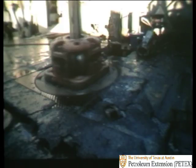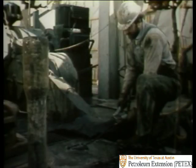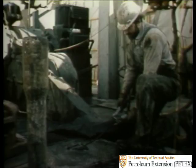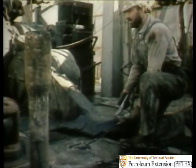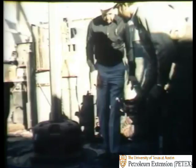There's not a whole lot you can do to ruin a rotary table. But forgetting to check the oil level daily is probably the primary one. And forgetting to grease the pinion shaft oil seals is likely to be number two. However, that's not what this man is doing. He is greasing the table lock, which is good maintenance, but not quite all that's necessary.